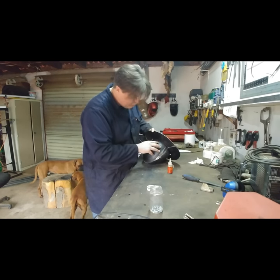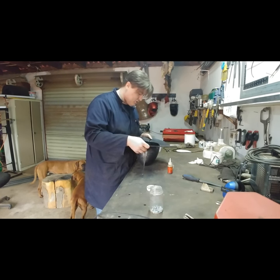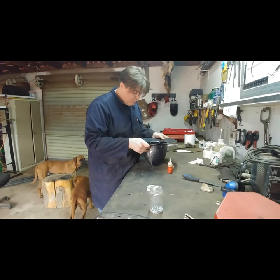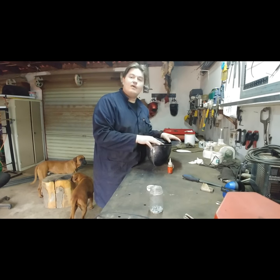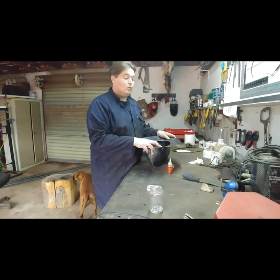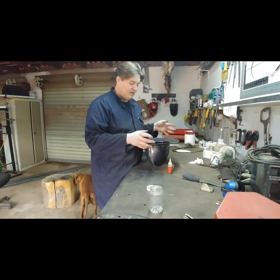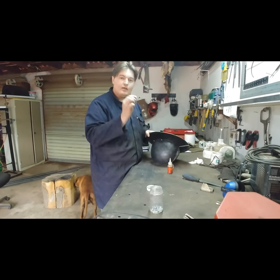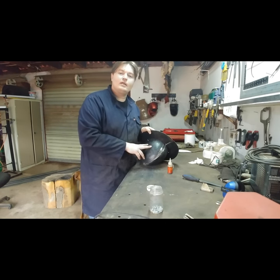For holes that don't fit nicely, I'd suggest just drilling through to open the hole a little bit. If you're making things by hand, matching up two holes is never going to be perfect. I've seen historical pieces where a hole was put in the wrong spot and they had to close it — without welding, that involved a ball-peen hammer. I might demonstrate that sometime if anyone wants to see it. For now, I'll just slightly elongate the hole by a millimeter to get a nice fit.